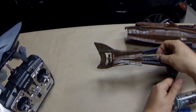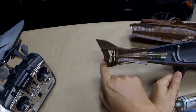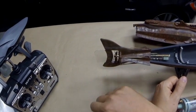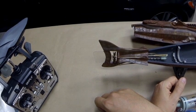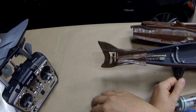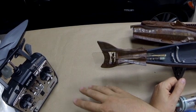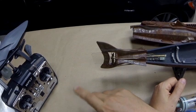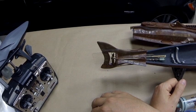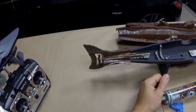The other thing I want to note is we've got a clear piece of plastic put into a groove in the rudder — it's friction-fit, no screws or anything. This basically improves the turning radius of this model by about 50% or maybe even better. The turning radius is probably about 3 to 4 feet, so it would describe a 6 or 7 foot diameter circle hard over, which is actually perfect. It gives you a nice tight turning radius that allows you to run this in a swimming pool or small pond without any issues.